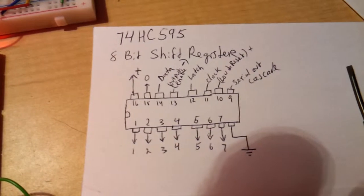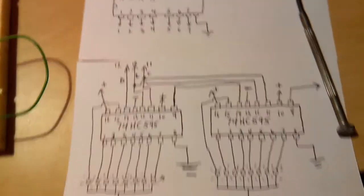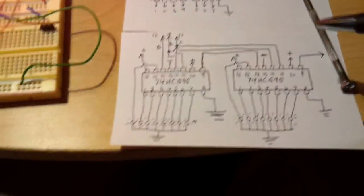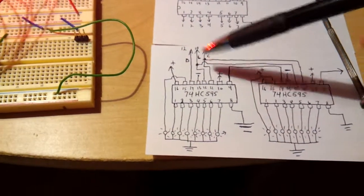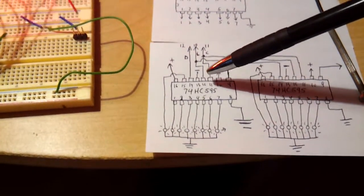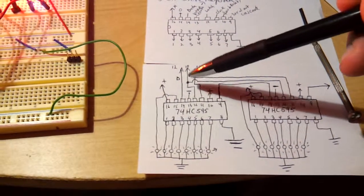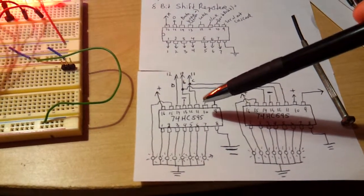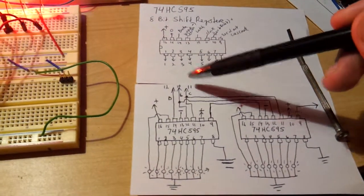Here's the wiring diagram — here's what it looks like, the pinout for the shift register, and here's two of these connected together with eight LEDs. So you have pin 14, the data pin, connected to pin 12 of the Arduino. Then pin 12 of the shift register, the latch pin, connected to pin 10 of the Arduino, and pin 11 of the shift register, the clock pin, connected to pin 11 of the Arduino.